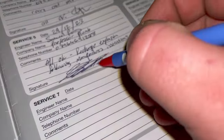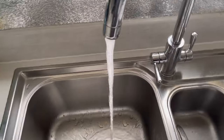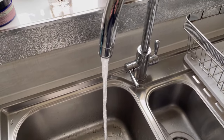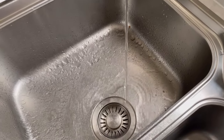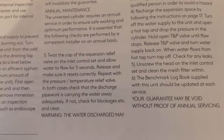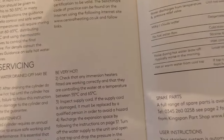We're not going to stand there - we're just going to put a key in. You can use a key or a pound coin, and if you trap that under the relief cap it will just allow air in itself. Then you can get on with filling out the benchmark certificate. Let's have a little look at the servicing page - it tells you all of the steps that you need to take.